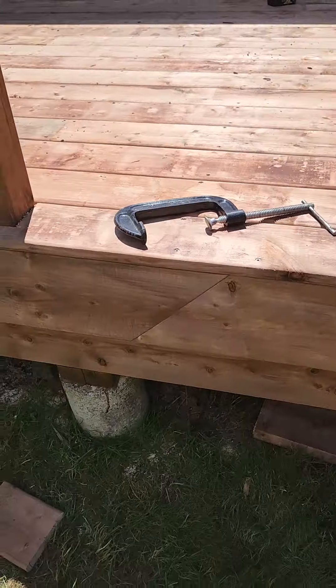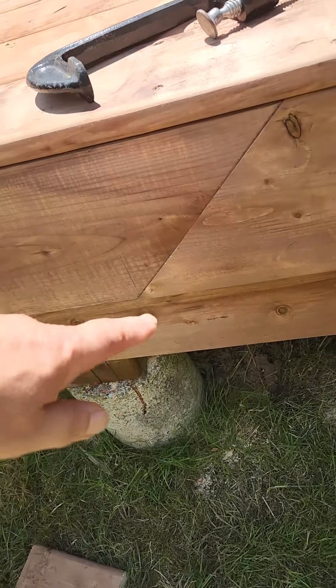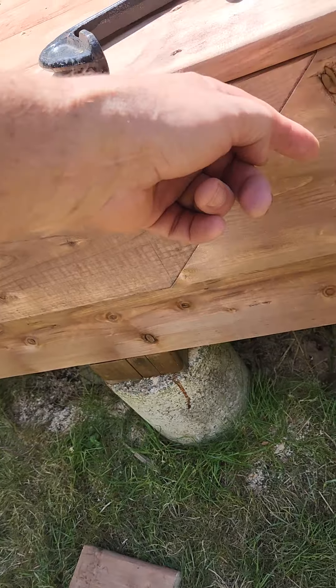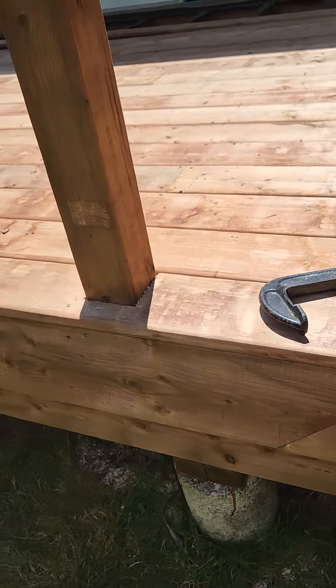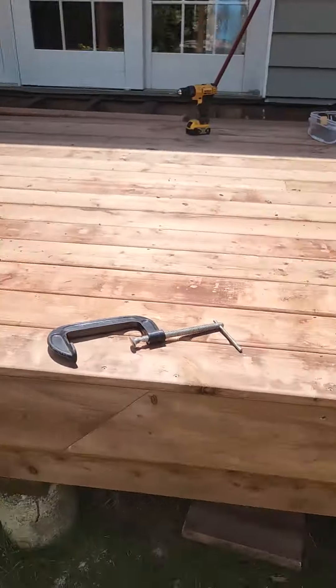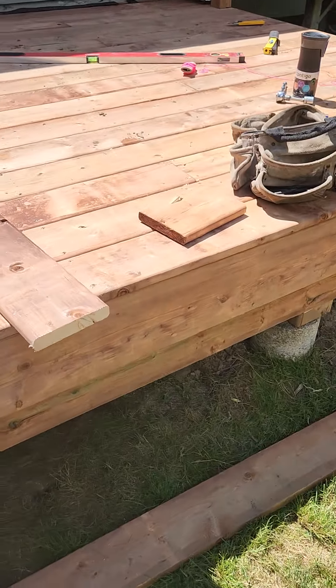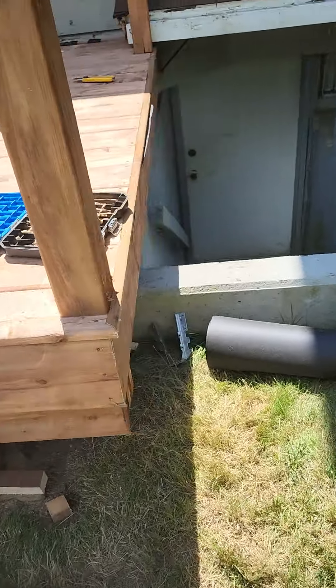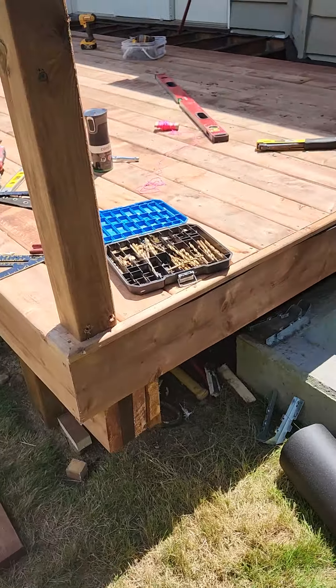The outer face down here I cut it on a 45. Screw in through here, screw down through there. I always try and save the nicest boards for the outside — with the less dings and blemishes in it. Same with the sides.